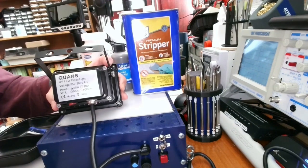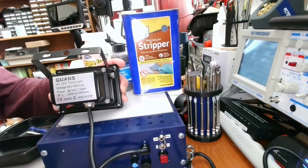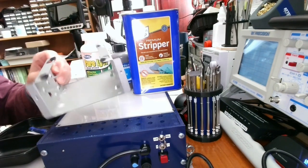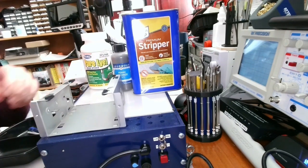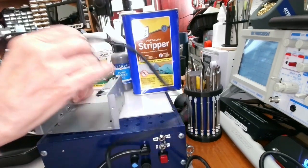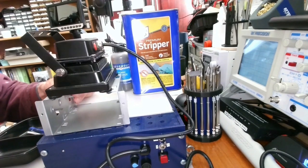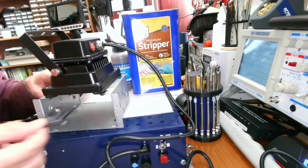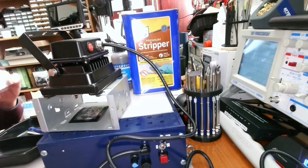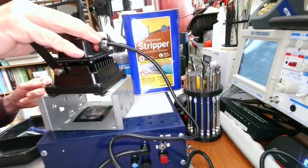Anyway, we have our light here, 10 watt UV light, 395 to 400 nanometers, and I've got a little cage here that came out of an old PC. It's actually a little hard drive cage, which I use in order to support this light. I put some little Velcro tabs on there, and it just sits on the top like that. Probably should line it up a bit better so you can see. And I put the PCB with the negatives on the top, supported by a few little pieces of glass that I got from an old picture frame, and that seems to do the job.